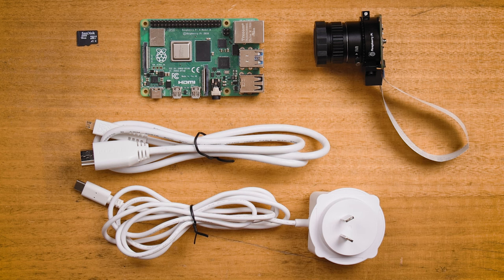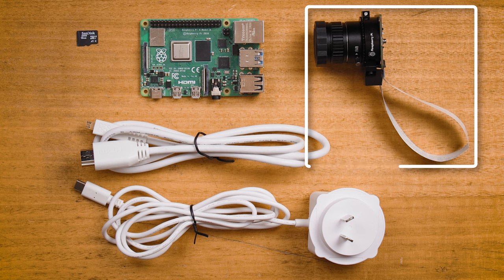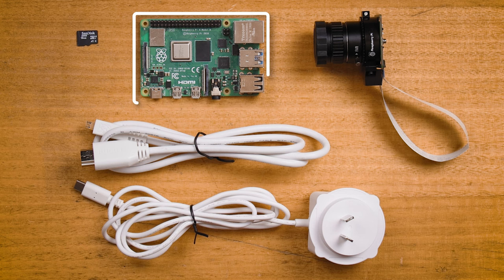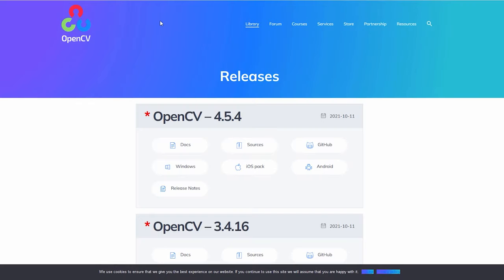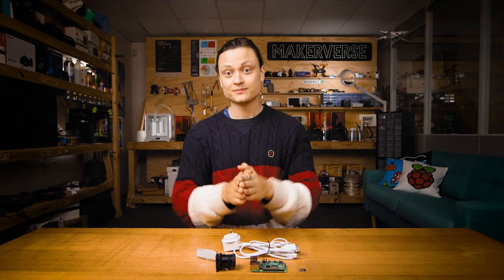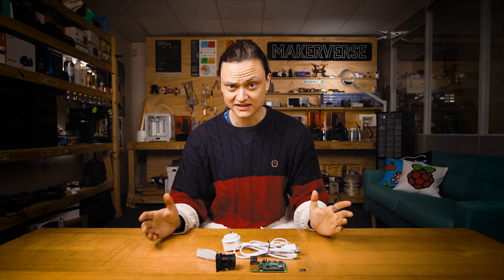Here on the table is everything you need to start locating hands. Naturally, you're gonna need a camera — you can use any Pi camera module. Today I'm using the high quality with a five millimeter lens attached to it. Bring along the most powerful Raspberry Pi you can get your hands on; here I'm using a Raspberry Pi 4 Model B. You're also gonna want a micro SD card flashed with Raspberry Pi Buster OS, connected to the internet, updated, and with the camera enabled. We have also installed packages such as OpenCV and MediaPipe. At the time of recording, OpenCV works best with the previous Buster OS. Jump to the article link in the description to see a step-by-step process. We will also set up our Raspberry Pi to run as a desktop, so a power supply, HDMI cord, and keyboard and mouse combo are needed too.